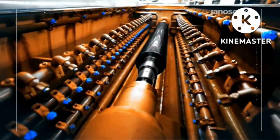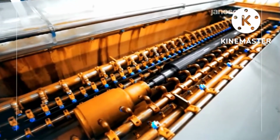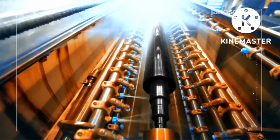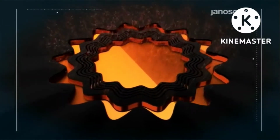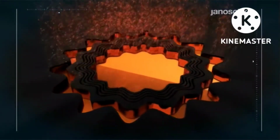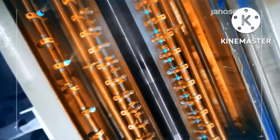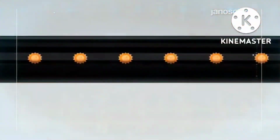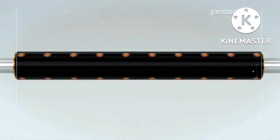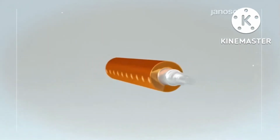Etching is a chemical process. The cells are etched onto the copper layer by means of an etching solution, which is the ferric chloride. This is exclusively possible on those spots where the etching resist was already removed by the laser processing. The etching technology ensures exact edges for the smallest fonts, lines, and symbols. The etching resist is completely removed before the last production step, the chrome plating.